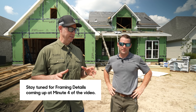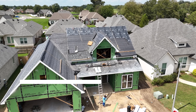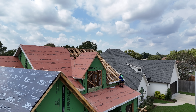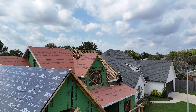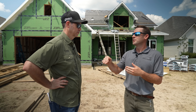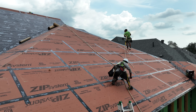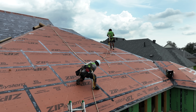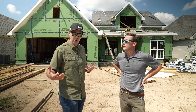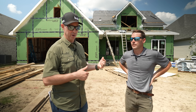When we look at the outside, fortified roof assembly — go check out our other video — but you actually built this with 5/8 inch roof decking, right? That's the zip system brown decking. And how did you nail that? It's nailed with a two and three-eighth inch ring shank nail every four inches into the rafter. That's serious business. And then you taped all the seams, which meant that you were basically dried in right away. That could meet the fortified standard for building — a standard for building a really resilient house in the face of what mother nature might throw at you.